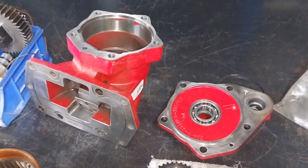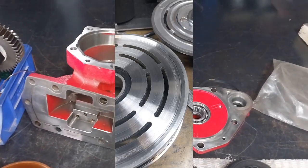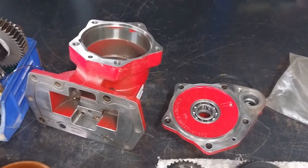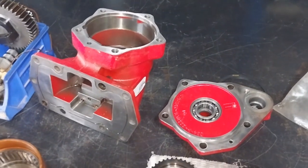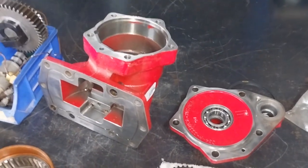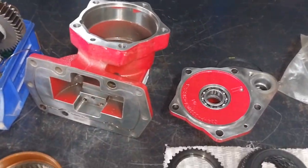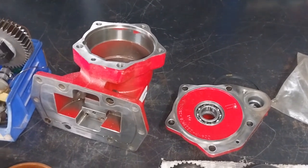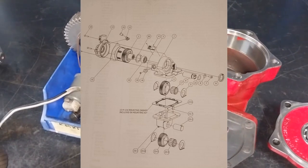The manufacturer is saying you need to burnish the faces, but we just don't know how much we need to burnish the faces to actually get something to grip. In his frustration, the owner of the truck says he has a big contract coming up — something to do with some races — so he wants us to leave everything as is. He reinstalled the original PTO that actually came out of the truck that we removed.